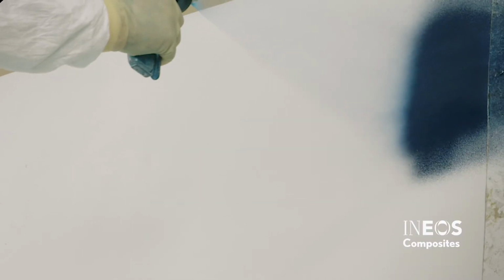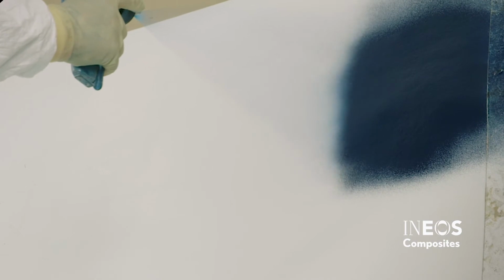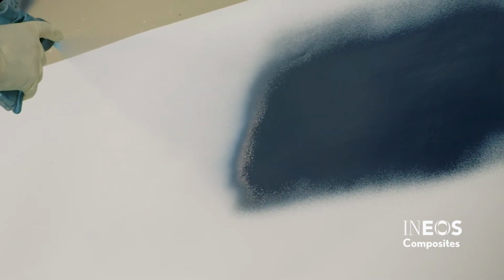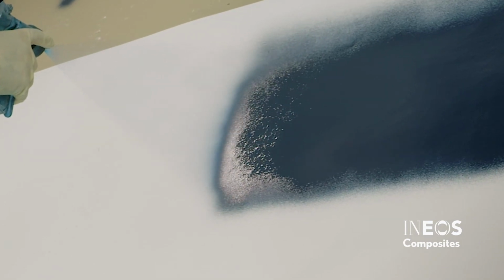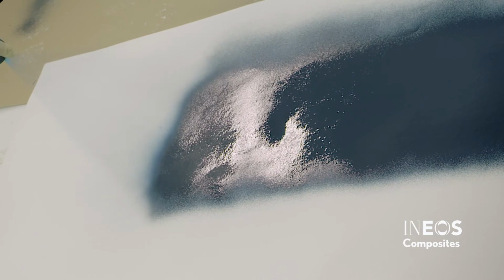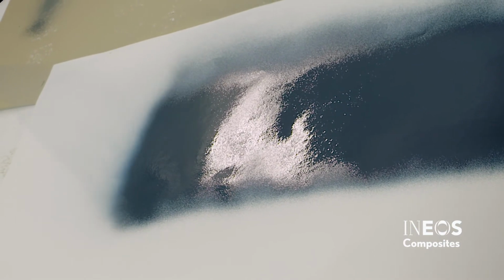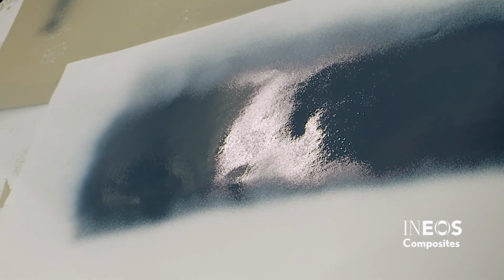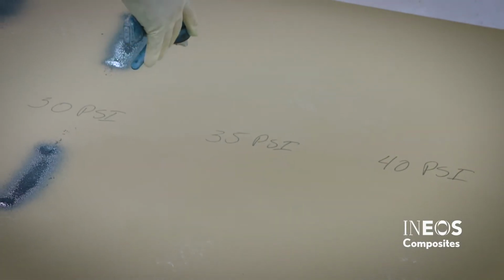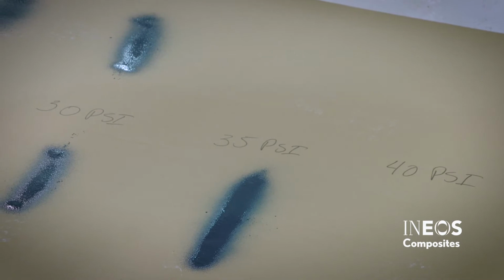As you continue calibrating the catalyst, adjust the fan pattern and pump pressure of the gun. You will want to spray the fan pattern on a vertical wall to verify pattern development. Using a vertical wall allows the catalyst to fall to the ground. If not properly atomized, pay special attention to any signs of catalyst fallout. It is crucial to verify that the catalyst is distributed correctly.